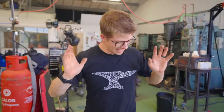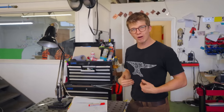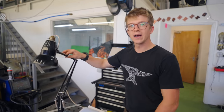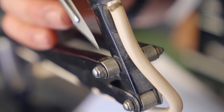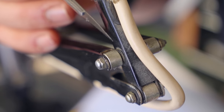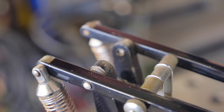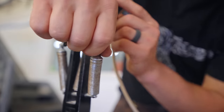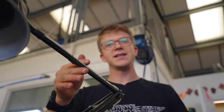So now, the engineering part of this is going to be challenging because the ratio of my strength to the friction and spring tension on this is quite appropriate for you to delicately move it about. They didn't really need to care excessively about excess friction. All they needed to do was put a little plastic washer between all the joints. There is a little washer. And that washer does help reduce the friction, but they're obviously not putting roller bearings in there to make it glide super easy, and the springs themselves are not overly strong. That's because this is tiny and light. It is a light, yeah.